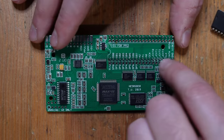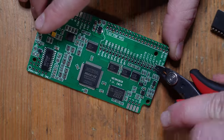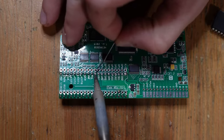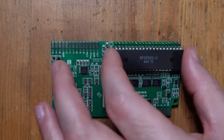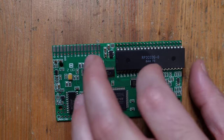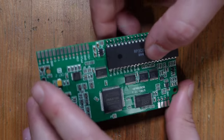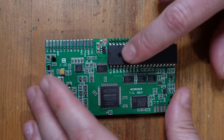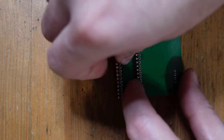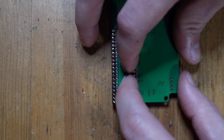Before doing that, we need to make these pins flush. I have flush cutters and I'll snip all of these pins. Now the PPU is inside the vias we're going to solder to. There's a notch at the top that matches the notch on the silk screen — definitely make sure you get that orientation correct. It's still a little bit crooked but way better now after cutting those pins. We'll flip it upside down and, just like every other step, solder the four corners first, make sure everything is aligned, then solder in the rest of the vias.